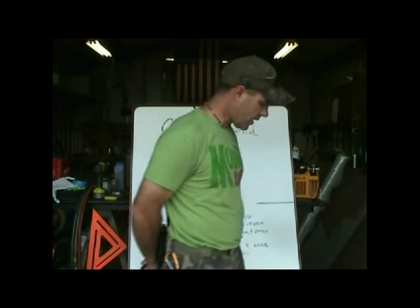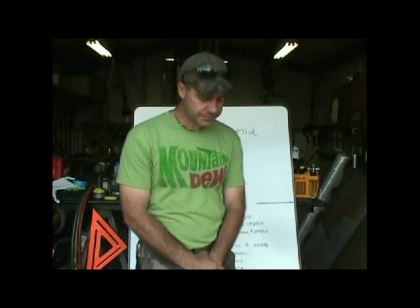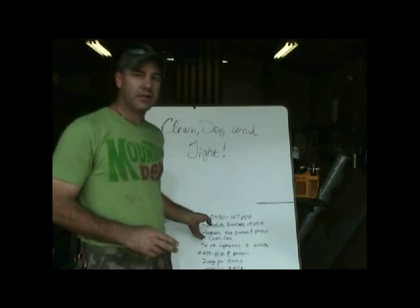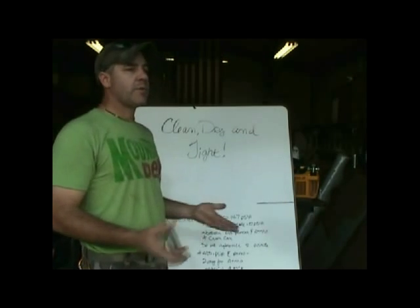This is not a physics class or an engineering class. It's to help service techs and whoever else wants to understand vacuum better, because the principles apply across the board. When I say a good deep vacuum, I mean 400 or 500 microns — not one or two microns. I don't want somebody in the electronics industry emailing me saying 500 microns is not a good deep vacuum. You're right — it's not for you, but for me it is, and we'll cover that.